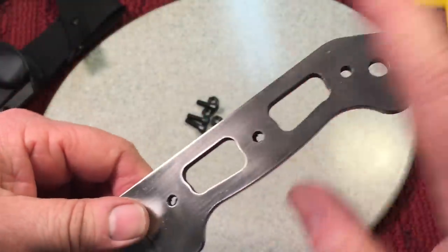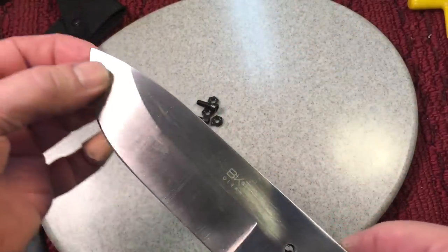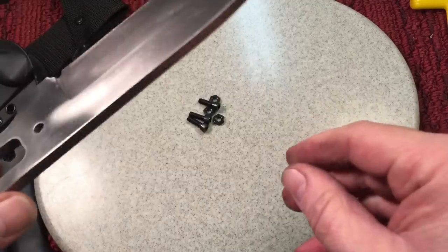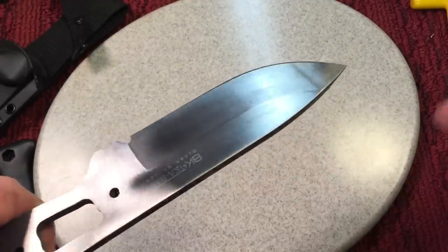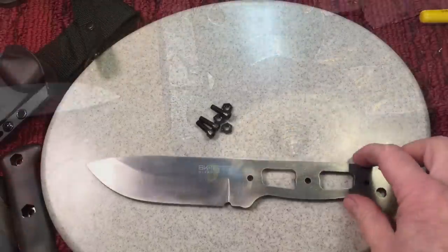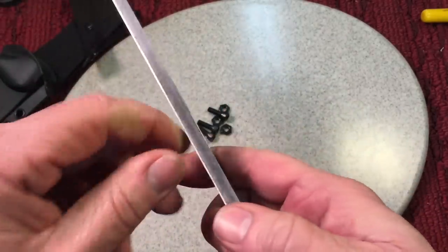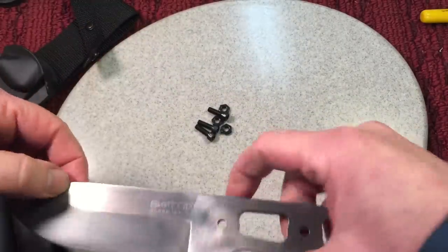I sanded this a little bit because I'm going to shellac that before I put the handles back on to keep it from rusting. Over here I'm just going to run this under the buff. You got to be very careful now because you don't have any kind of edge protector. When you're doing this on the buffer, always make sure the wheel is never contacting more than three quarters of the way up or it could flip it around. You got to have two hands or be real careful. We'll just put a little bit of shine on here, put the scales back on, see what it looks like.